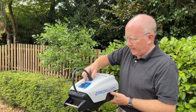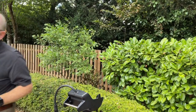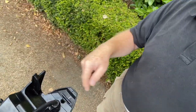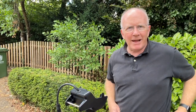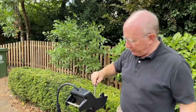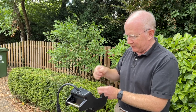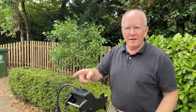If I take the battery off for a moment — in the top of here, let me show you — there is a little hole which goes through, and there is a key which goes in there and locks the motor in a fixed position. It's a little plastic key; when I bought the engine I had no idea I'd ever use it so it was locked away in the packaging. But I did manage to find a metal rod of the appropriate size which goes in here, and the motor is now locked in a forward-only position. So that's the first thing — I can get rid of the tiller.